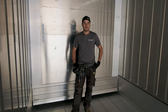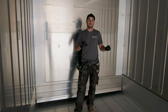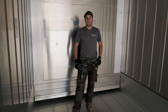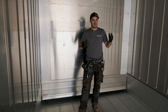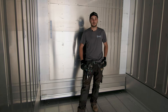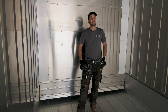Talking about the envelope: on 53-footers it's typically two inches of foam on the walls and three inches in the floor and ceiling. I think these are closer to two and a half to three inches in the walls, floor, and ceiling, giving you roughly an R20 wall system. But this will perform so much better than a standard R20 wall with two-by-four studs and fiberglass batts - that's an ideal-scenario R-value, whereas this is a real R20 that would likely compete with a traditional R28 to R40 wall system.